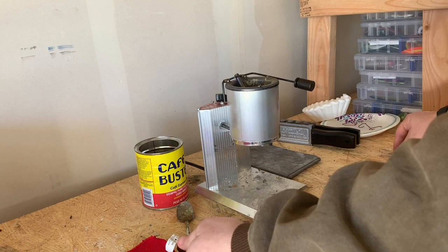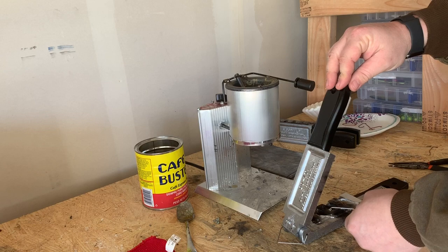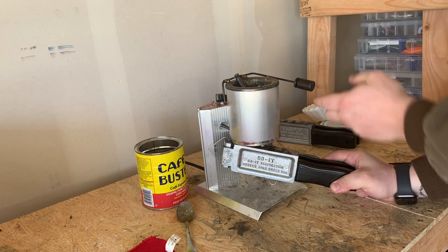You can see I tilt it back a little bit — some jig molds are finicky. This one particularly likes the pour spout really close and the mold itself tilted back. You're just going to check it over, make sure the collar poured out right, grab your next hook, put it in the mold, and repeat the process until you're done pouring for the day or until you run out of lead.